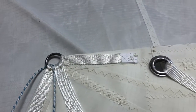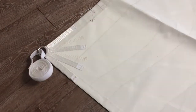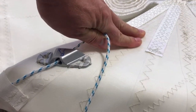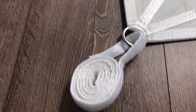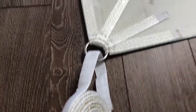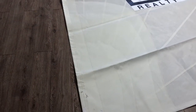Flipping over here, we have the foot line with the cleat. The customer requested the loose foot configuration. Working over to the clew corner, there's a nice big ring with webbing reinforcement. For all loose foot configuration sails, we provide additional velcro webbing that can wrap around the boom to provide additional support and pull the sail down onto the boom.